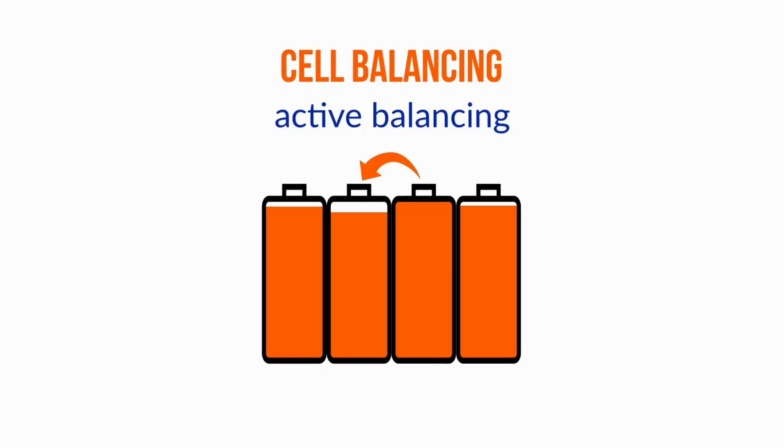Let's talk about that briefly, because we're seeing large series connections to get to high voltages in electric propulsion — 400, 500, 600, 700 volts sometimes — and not all of these batteries are set up to balance in series. That's really important. If you've got two 12-volt batteries in series on a 24-volt system, you need to make sure there's balancing between the battery blocks. With multiple parallel batteries, you could have one cell drifting out of balance. All cells need to be balanced across all batteries, whether in series or parallel, and most drop-in batteries do not have any capability for balancing between batteries.